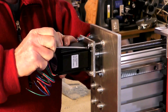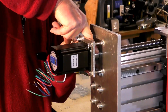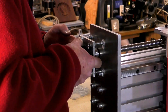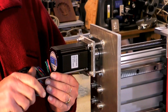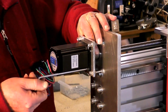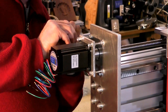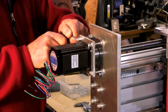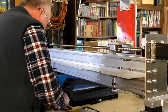And that's where I prefer to use preloaded bearings. Just a simple attachment method for the X drive. Up on top there, they're not 8mm bolts, they're 6mm — some long 6mm bolts and some nuts. So it's fully adjustable. I could adjust that plate out or in and get it exactly what I required, rather than making more bracketry. I've used that method before and it works quite well.